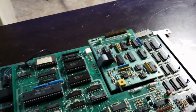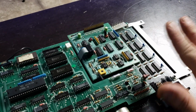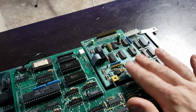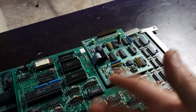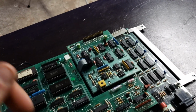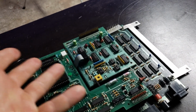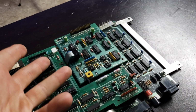But this allowed you to use single-sided double density, which is what almost every computer was using in the 80s, basically. And it lets you use up to 180K per side. I mean, realistically, it's not double-sided, it's still single-sided, so you have to flip it and notch it. But yeah, it's a lot easier to use modern, or more modern, 5 1/4 floppy drives to read and write these. So hopefully I'll be able to create more software in the future.